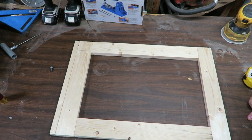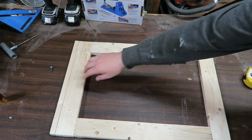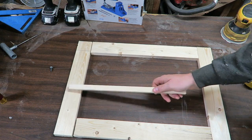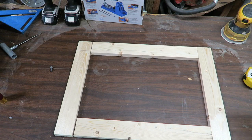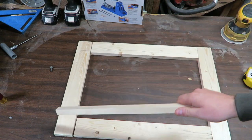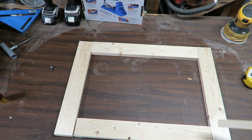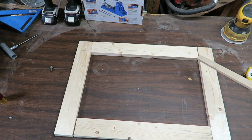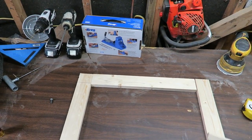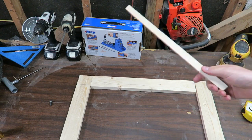This is how I've decided to lay it out — instead of cutting each corner at a 45, I just butt the sides up. This piece I took off is about three quarters of an inch, not half inch. Now I'm just gonna sand these three or four pieces with 220 grit, then put it in the pocket hole jig right there and put pocket holes from this piece into this one. That way it's held together. You could glue it if you wanted to. I bought this pocket hole jig from Home Depot for about a hundred bucks, so I'm gonna use it.